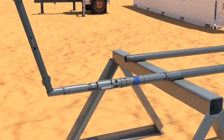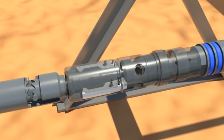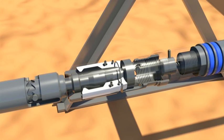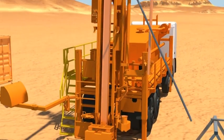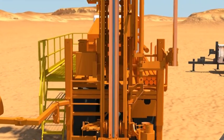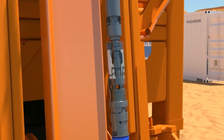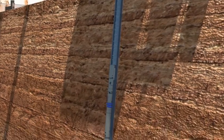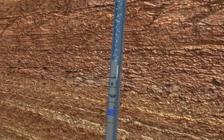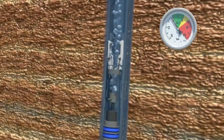The new Sandvik Universal Head Assembly incorporates a special patent-pending IQ Fluid Control Valve, or IQFCV. Without any tools, this valve is easily set into position before being pumped or lowered into the drill string. Upon landing, the IQ Fluid Control Valve sends a constant high water pressure signal to alert the operator that the inner tube has landed and has positively locked into position. This robust indication system prevents mislatches from occurring and gives the operator peace of mind.